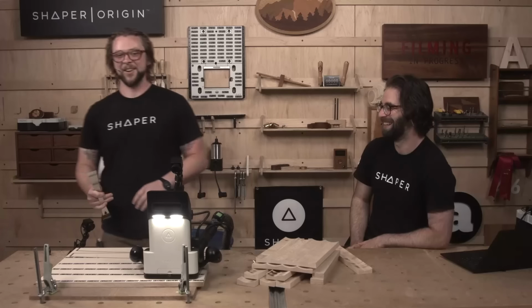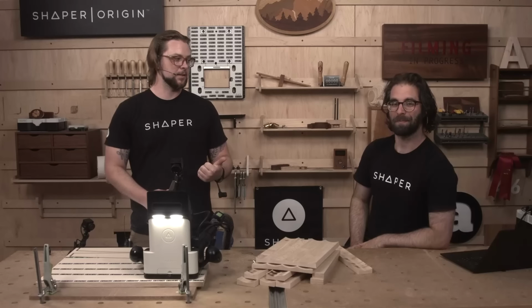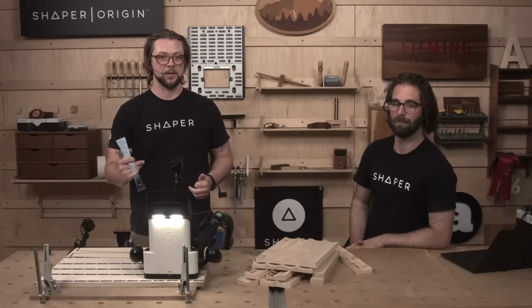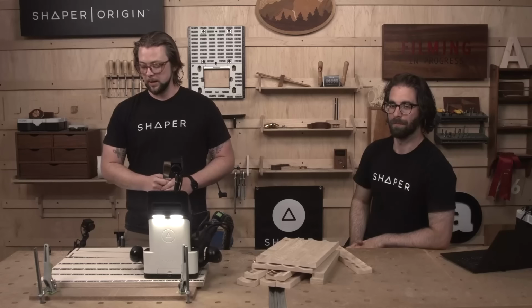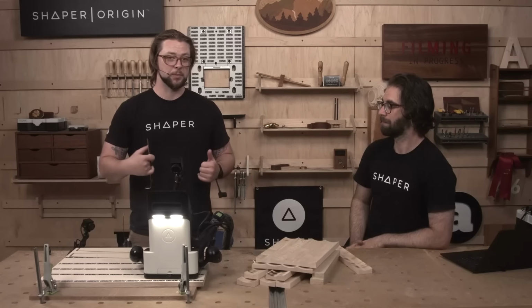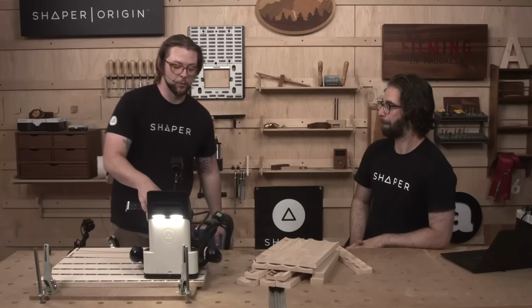No. And that's because I know I have that roughing offset. So if I were to fall out of bounds, I'm confident that I'm not going to have a huge gouge in my finished part. And two, it's plywood. It's pretty consistent throughout, so I'm not worried about hitting any weird void, relatively voidless plywood.